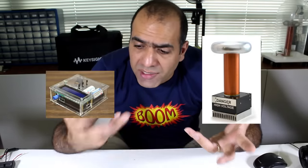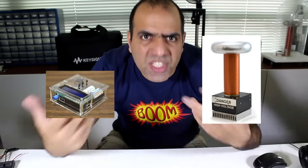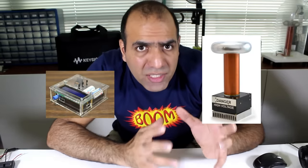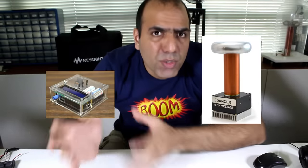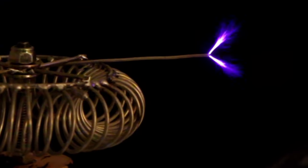The manual says to start assembling the interrupter first. This device is made of two pieces: the Tesla coil with its driver, and the interrupter. The interrupter interrupts the power output to the Tesla coil at a certain frequency — so depending on that frequency, you hear sound from the coil. You load music into the interrupter and it plays those frequencies to the Tesla coil so you can hear music. If you run a Tesla coil freely with no interruptions, it's typically very low noise. The resonance frequency is way beyond human hearing — in the hundreds of kilohertz to megahertz range. You only hear sound when you interrupt the output at audible frequencies.